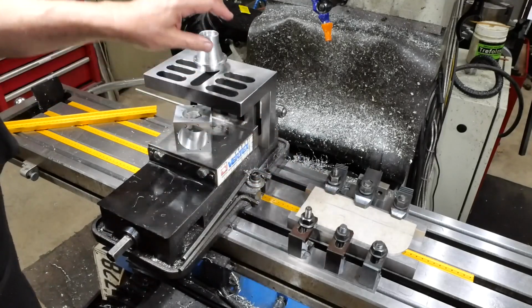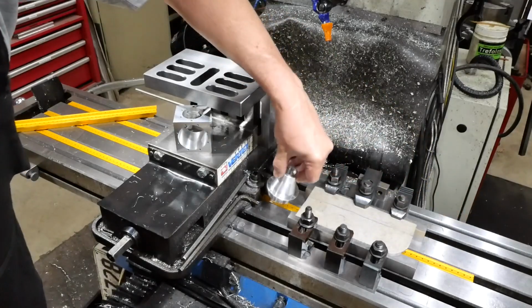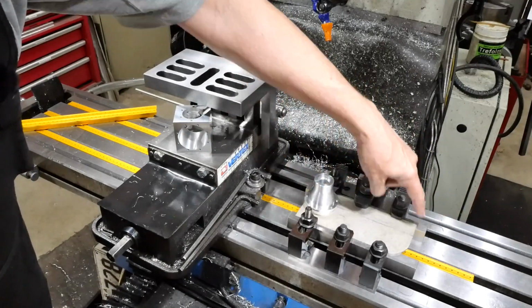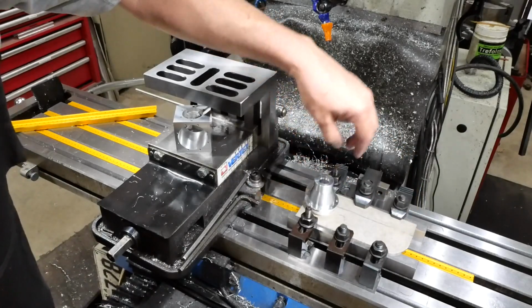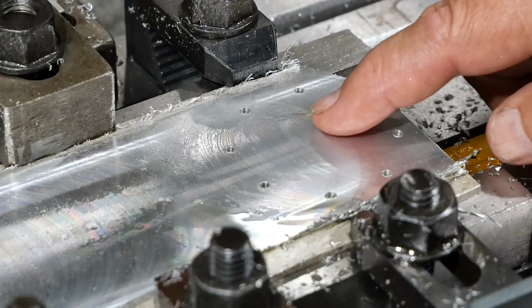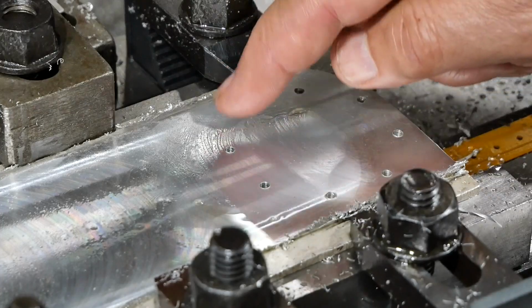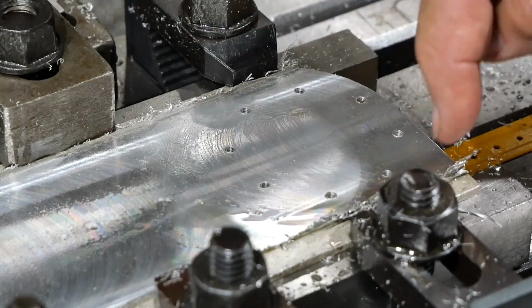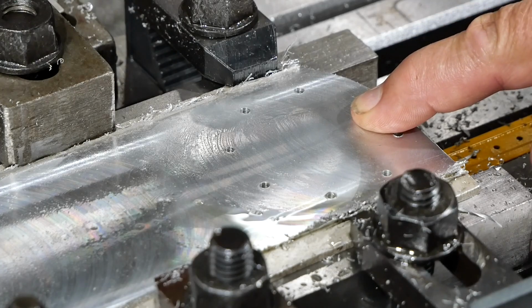But with this setup here, there is actually enough space between these. I can't see very well, but there's just enough clearance between these parallels that I can do the smoothing cut and then drill the bolt pattern all in one setup. Yeah, I'm not happy with that. I realised that when I cut that out, those faint cutter marks are going to look weird on the round disc. So I'm not going to go ahead with that. That was a waste of time, as it turns out.